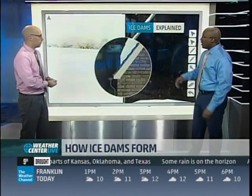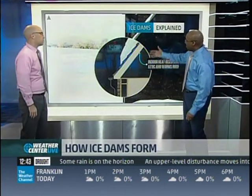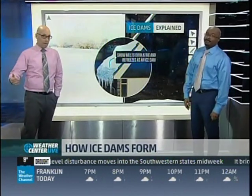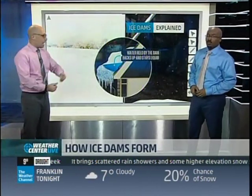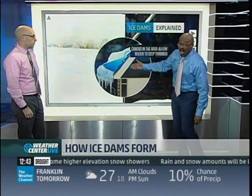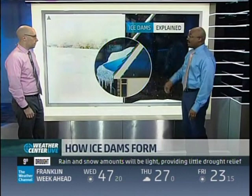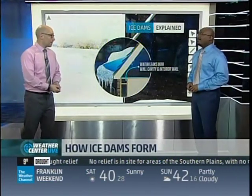Here's how that all comes together. Let's talk about a mock-up of a home and a roof. Heat rises, and in the home that begins to rise up towards the attic, warms the roof, and that helps to melt what's on the roof. And yet it's still very cold out, so that new melted snow refreezes into the gutter system. More water is then blocked, can't get through the ice, and you wind up building up water behind the ice in the gutter. If there are any cracks in the roof, the water that's built up begins to seep through, and now you're dealing with a problematic situation — water on the inside of the home, which is something we're all trying to avoid all times of year.